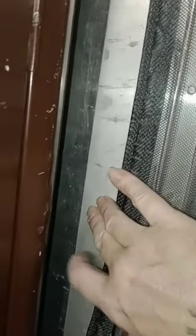The ceiling is going to be attached to metal surfaces - there's not going to be any wood. I'll be crushing or separating the rock wool in here - that's about two inches there. This over here is going to have rock wool - I'll just go ahead and run a run of rock wool down there since I'll have an extra batten. That entire rest of the wall is going to be filled up with rock wool.